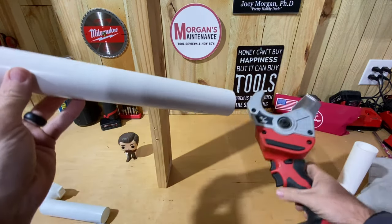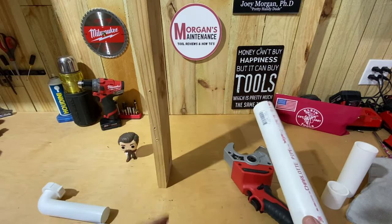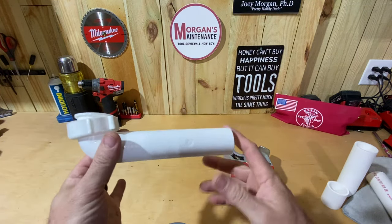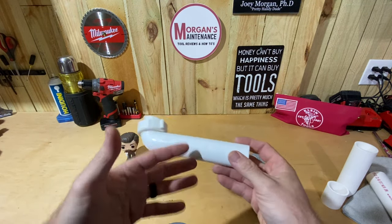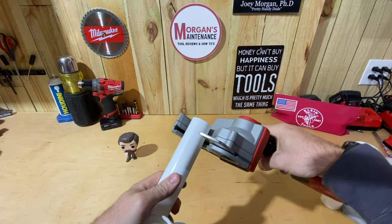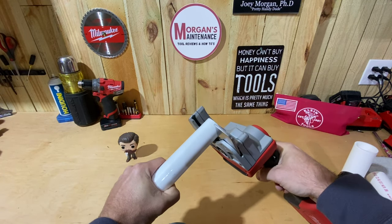PVC up to two inches — I haven't had one problem with it. The only issues come with old piping, but that's about brittle PVC, not the M12 tool itself. Now, will it cut the thin-wall pipe underneath your sink — p-traps, tail pieces, extensions? If you need to cut something to length, the bottom line is: no. You might get lucky occasionally, but the pipe is so thin that the pressure basically breaks it rather than cuts it.